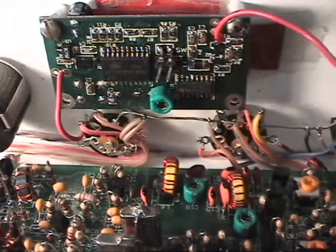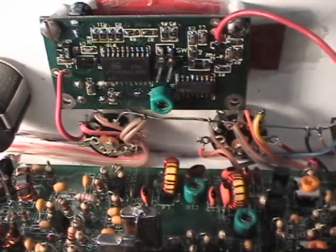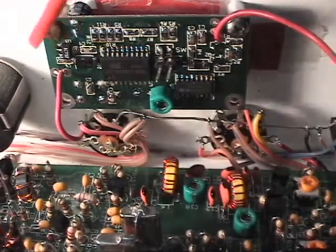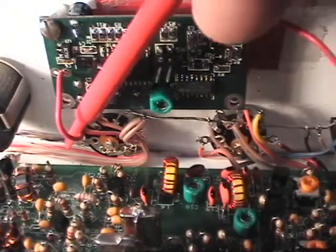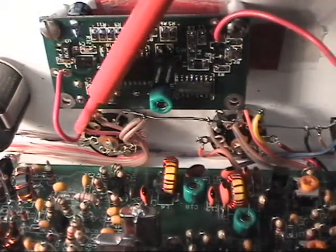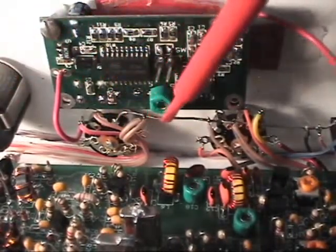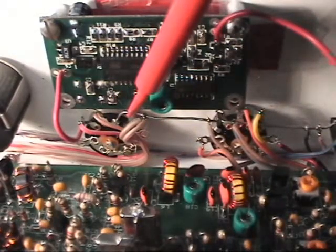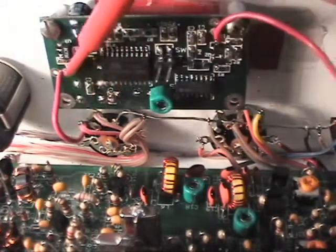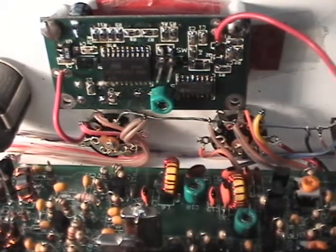We're looking at the back of the front panel. This is the fine tune pot and this is the volume pot. I've got mine hooked with a ground bus across the whole front panel so that I can remove the board relatively easily. One side of the fine tune pot goes to plus 8 volts — the regulated VFO voltage — and the other side goes to ground. We can just pick up the plus 8 volts from right here, where we're already picking it up to drive the digital dial, and we'll pick the ground up from the other side of the pot.